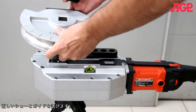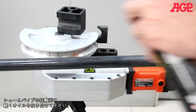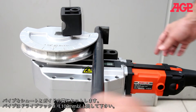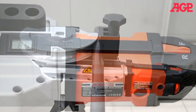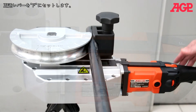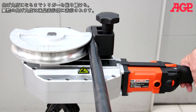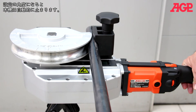Select the correct size bending former and shoe. Add some light oil to the tube. Insert the tube into the bending former with at least 10 millimeters projecting beyond the driver hook. Mount the shoe and shoe pivot bolt. View the LCD screen and set the desired angle by turning the degree selector thumb wheel — we'll adjust to 90 degrees. Set the direction lever to forward by pushing the lever to the right F position. Press the trigger switch and hold until the pipe is bent to the desired angle. Actual degrees will be displayed during the bending process. When the angle is reached, the machine will automatically stop.